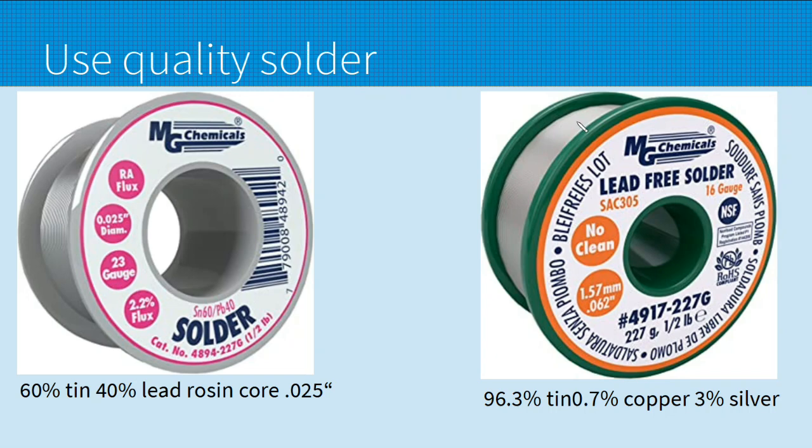If you're outside the US or in a country that prohibits lead solder, you'll end up using lead-free solder. That's going to be around 96.3% tin, 0.7% copper — which has a much higher melting point — and 3% silver, which also has a much higher melting point. I'm not going to make any judgments about lead-free solder; I don't use it enough to have a strong opinion, but it works. My choice would be lead solder if you can get it. Use the thinnest solder possible for the job with the widest tip on your soldering iron — that way you're getting the most heat into the joint in the least amount of time.